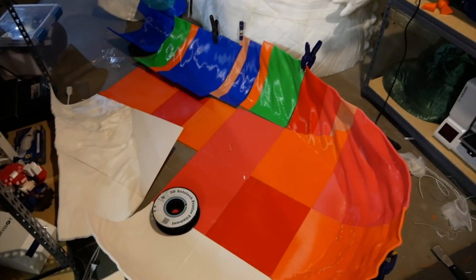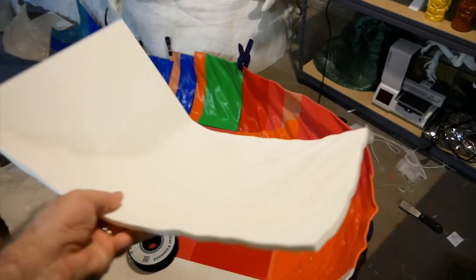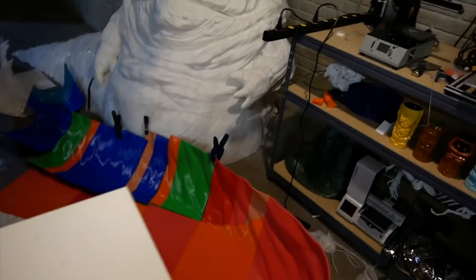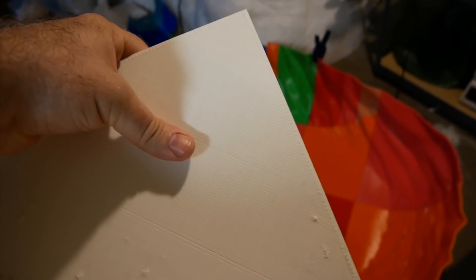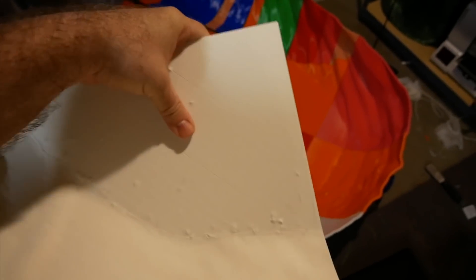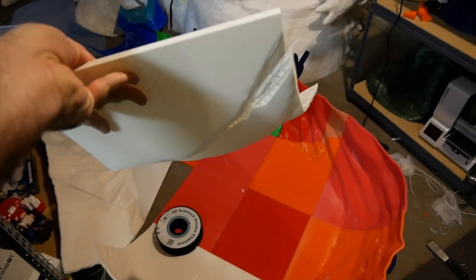One problem I did run into when I was printing these bottom pieces is that some of them would be just strangely weak. Here's one that I made that ended up that way, and I'll show you what I mean by that. First of all, if you sort of squeeze it, you can hear crackling. That means that it's not been properly bonded — the layers and everything are not all bonded into one piece as they should be, and so this is not very strong at all. In fact, if I just take this and press it up against my body, I can do that. Obviously, this is not what we want for Jabba's bottom layer.